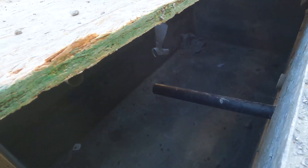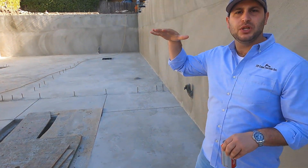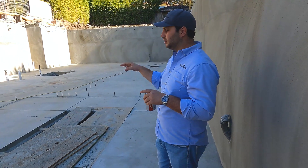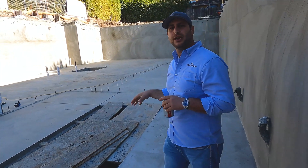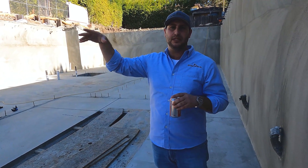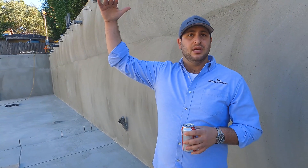What we're looking at right now is the sump pump pit. The reason it's below the slab is because all of the water around the property and all of the plumbing in the slab is being directed into this pump — into two pumps. There's a gray water and a black water pump. Those pumps are then directed out into either the LID planters that will be placed later and then into the street, or pushed into the sewer line and then into the main sewer line. That's for sloping and getting everything pushed out to the street. Obviously the higher you are, the more natural slope you have, the better.